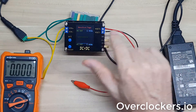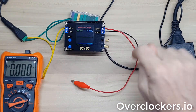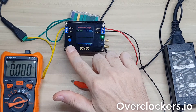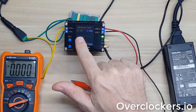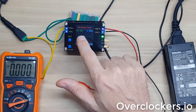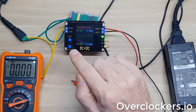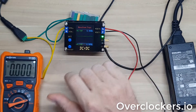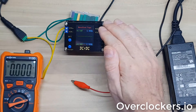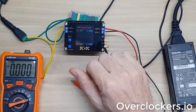The next screen gives a waveform of the power the device is set for and the amount of power actually being consumed at the output. It's currently set to off, so it won't show anything, but if I set it on, it should show the voltage I had set. You can see it initially jumped up to 10 volts and then came back down to 6 volts. You need to be mindful that it does have a bit of a spike when it turns on before settling to the set voltage. Now I'll turn it off and it drops back down.